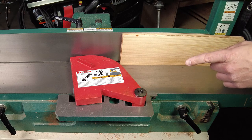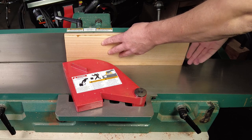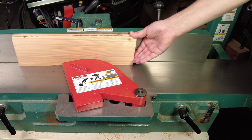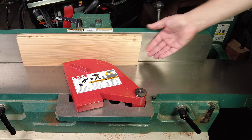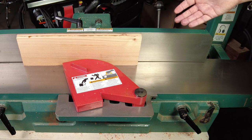I didn't do that this time. Here's what I think I did: my left hand was where it always was, but my right hand — I had my thumb on top of the board, and you can see where my fingers are. So what happened is I fed my hand right into the cutter, and I must have dropped down right at the end because it involved three fingers. Just know that this finger is now a quarter of an inch shorter than it used to be.